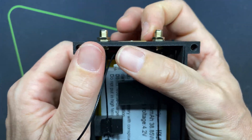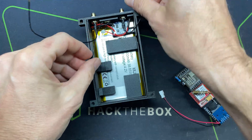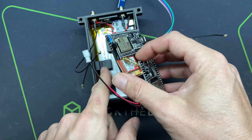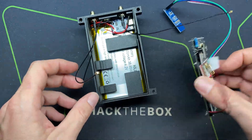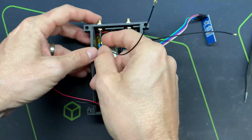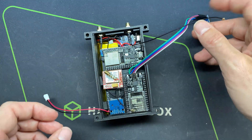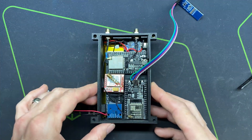The GPS antenna should pop right into place with a nice flat mount on top. Now I'm going to take the wires from the two WiFi antennas and move them out of the way. The GPS antenna cable flows through this trough and plugs into the GPS radio on the bottom of the J. Hewitt board; I'll plug it in and run the wire through the trough as I seat it — it should fall right into place and be nice and stable. Then I'll run the left antenna down the side and plug it into the bottom ESP32, and bring the other antenna in a loop back up.